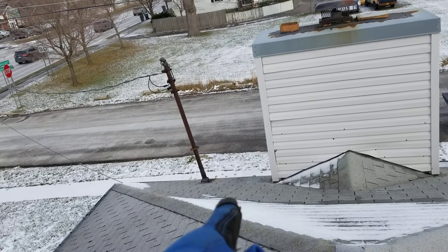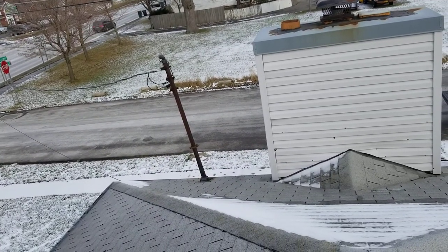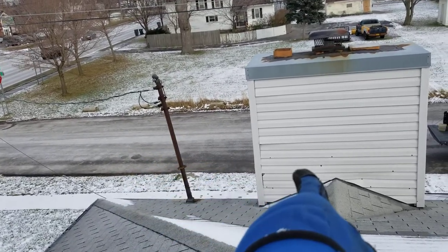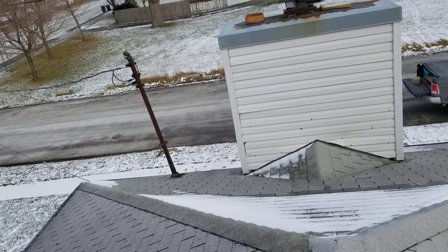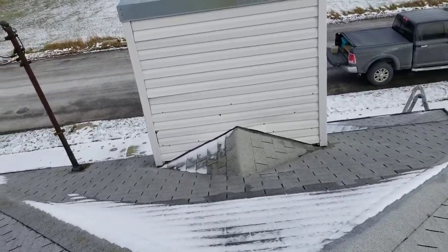Their electrical mast — it looks like it's snapped and rusted out at the roof. If we can come back with a turnbuckle to tie into the wall stud of the chimney, we might be able to straighten it out if it isn't in too bad a shape. But that is something that should be looked at.